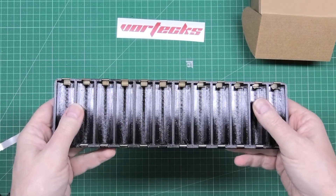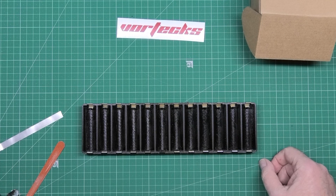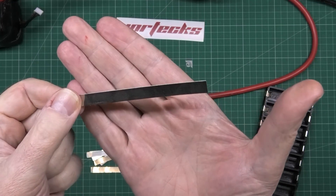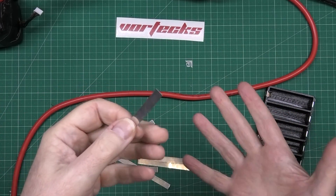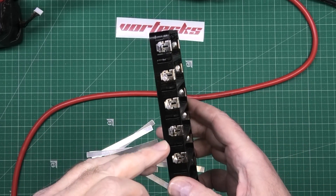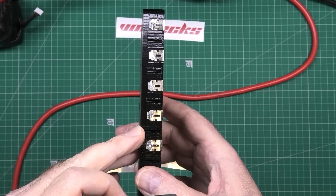When you've done that, you get your spot welder out — my battery's just charging. This nickel strip is 6mm by 0.2mm — I think it is, I hope so, that's what I paid for. You need to cut 10 of them to go through the slots.